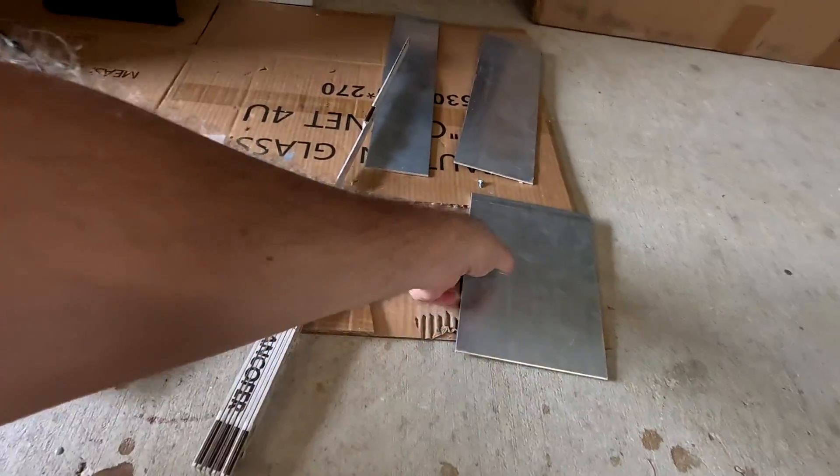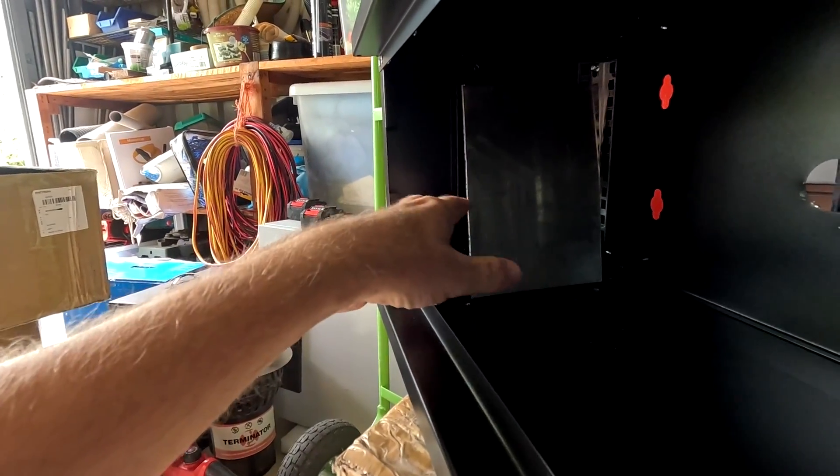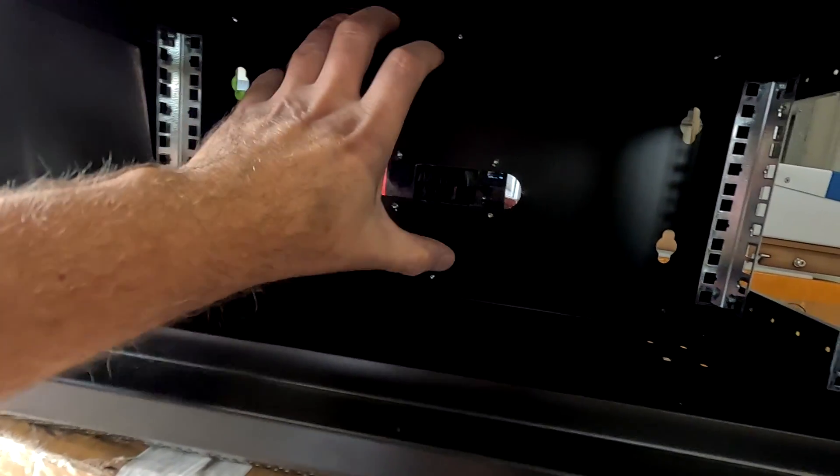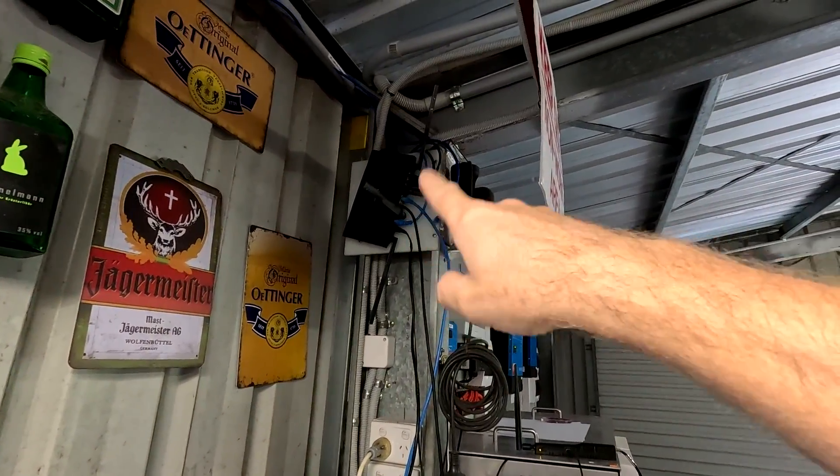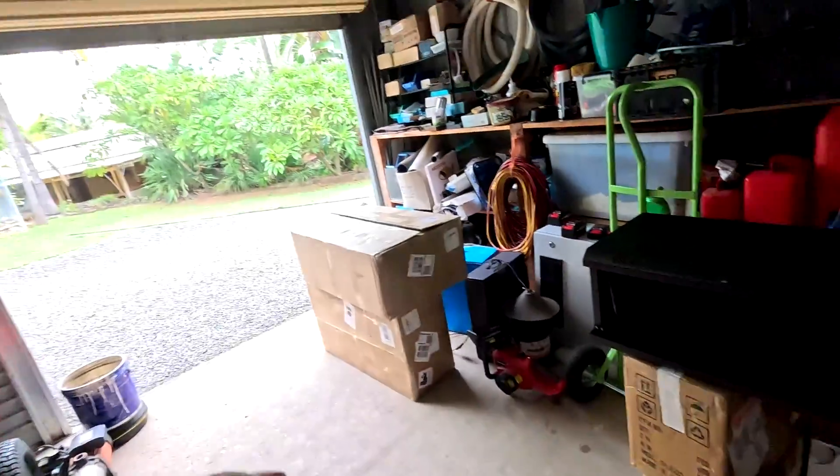If something goes wrong with these step-up converters, the worst case is they supply 12 volts to the 48V PoE switch or to the Intel NUC — that will either shut them down or they won't work correctly, but they're not going to explode. I found an aluminium offcut that's almost exactly the plate I need. I'll cut another aluminium plate for a backplate, then mount the Intel NUC, PoE switch, and other equipment vertically. The WiFi access point might be a problem inside a metal cabinet if the signal gets too weak — we may need to mount it on top instead.